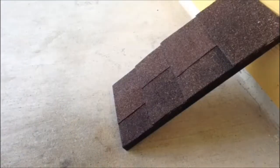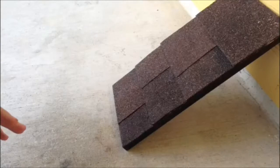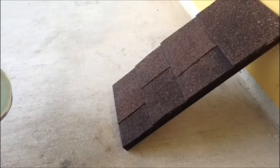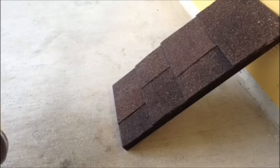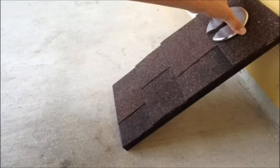Today we are going to be demonstrating how to install a solar panel on a sloped composite asphalt shingle rooftop. On a flat rooftop, solar arrays are commonly installed with a ballast system. On a sloped roof you obviously can't use a ballasted system, as the weight of the ballast and the system would simply slide off. This is a composite asphalt shingle roof mockup at approximately a 10 over 12 slope. A straightforward weight simply slides off the rooftop.